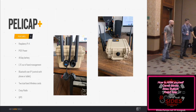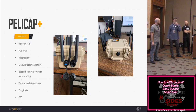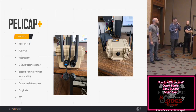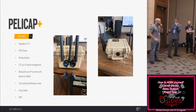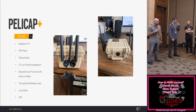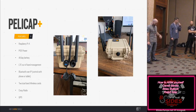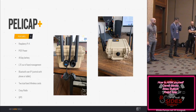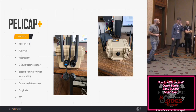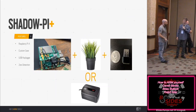The LTE hat we're using is from a company called SixFab, which put out an LTE hat for various providers — T-Mobile, AT&T, Twilio SIMs. Compared to USB LTE dongles, the hat is way more stable and just works. It's also pretty fast — 50 to 60 megabit, no problem.